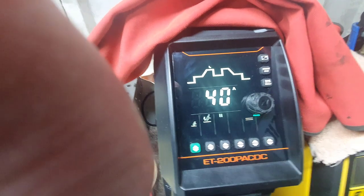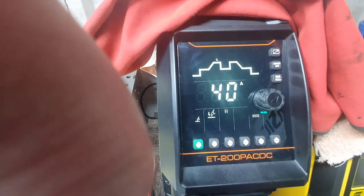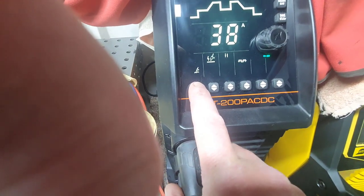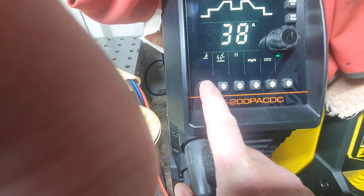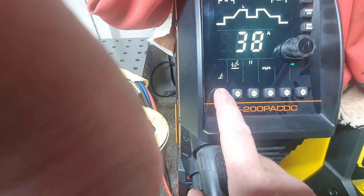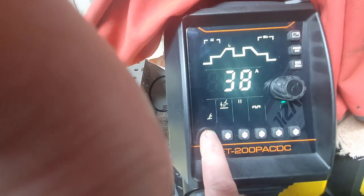It's more of a Fronius-look display but obviously it's not a Fronius. Now literally on the panel you've got these buttons here - that one selects. So you've got AC at the top, you've got DC, and you've got mixed - mixed is basically AC but I believe you've got a bit of DC with it in parts. I've yet to try that but it'll be interesting. All the newer TIG sets basically have a mixed mode as well, so it'll be nice to see in a few months what the difference actually is.